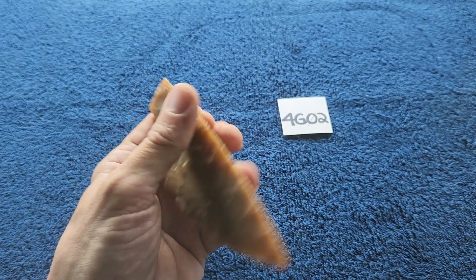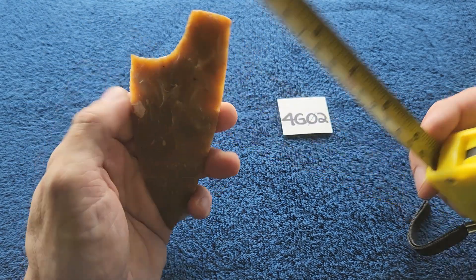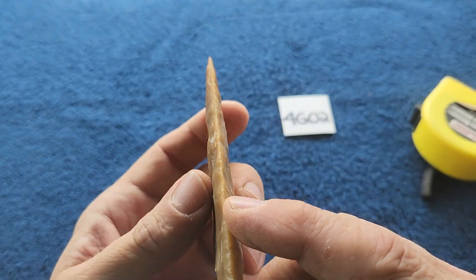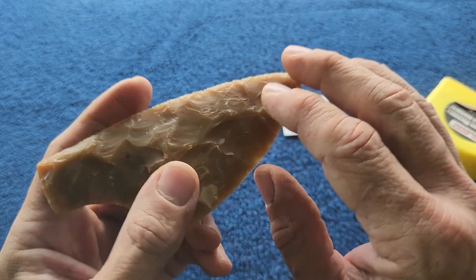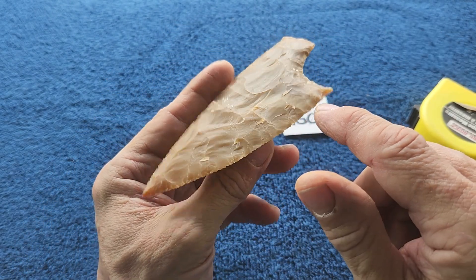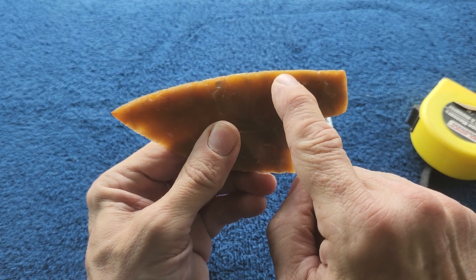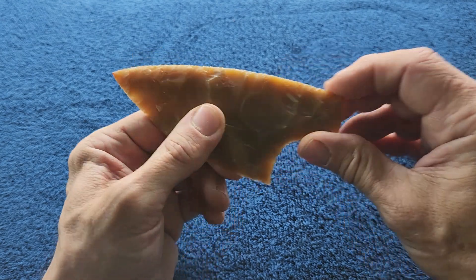This is just a regular modern-looking knife blade, five inches — just a tiny bit over five inches — by two and an eighth. I can make these pretty fast, which is why I end up making a bunch. I only have to concentrate my intense effort on one edge. Everything else is pretty straightforward. I grind it from one end all the way around so it won't cut you.